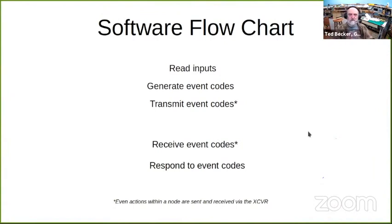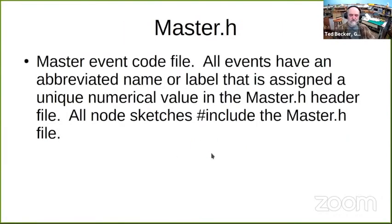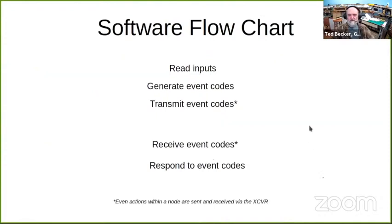Just a quick overview of the software. I divide the software into two main parts. One is I read the inputs, generate the event codes, and transmit the event codes. That's one function, and in my main loop, that's usually just a function call, and that goes off and happens. The other part of it is just to receive and respond to event codes. And even things that are happening in the same node, like what I showed you, the panel there that had both push buttons and controlled switch machines, the signal path is still out over the network